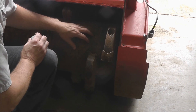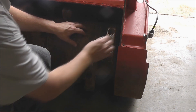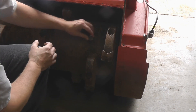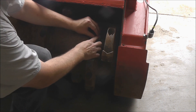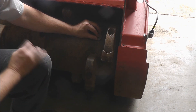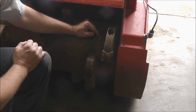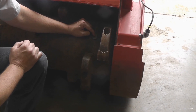We've determined the position on the rotor where we want to weld. There's a tool near the end of the rotor, so we can't weld that close. The closest position we're going to be able to put this weight is right about here, giving us enough room closest to the edge of the rotor without interfering and enough room to weld. This is our 40-gram weight. We're going to weld that and then run a final test to see if it drove our vibration down.